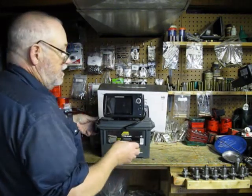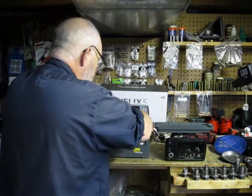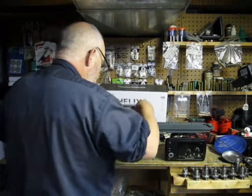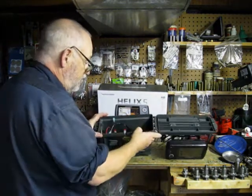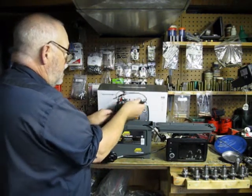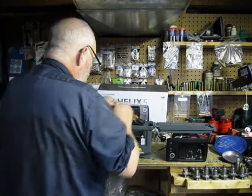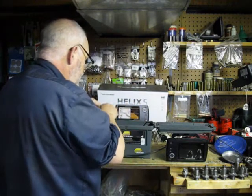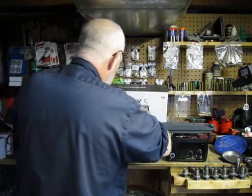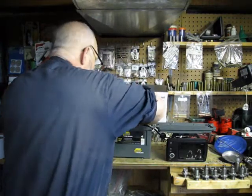When you get home and you want to get your batteries out to recharge, you have to take your transducer out. You can tuck your wires in any way you want — this is the way I did mine. Your power and transducer wires tuck inside; it keeps the battery from moving around because there's the battery in there right now. You're going to want to take your battery out — there's the little green light on — and replace it with another battery. Put your battery in, put your wiring harness behind it and tuck it in. Then tuck in your other wiring setup and that takes care of battery movement because now it's wedged in there nice and tight.